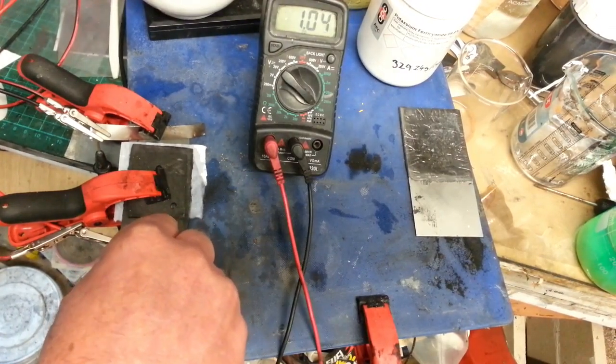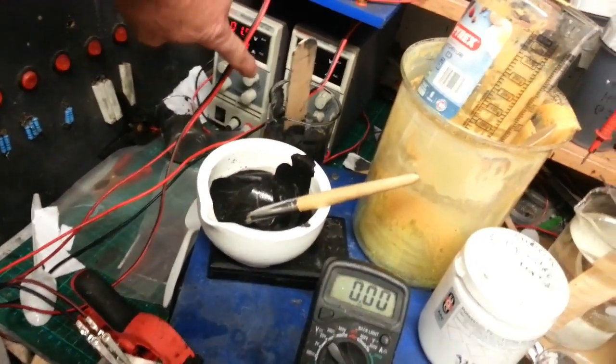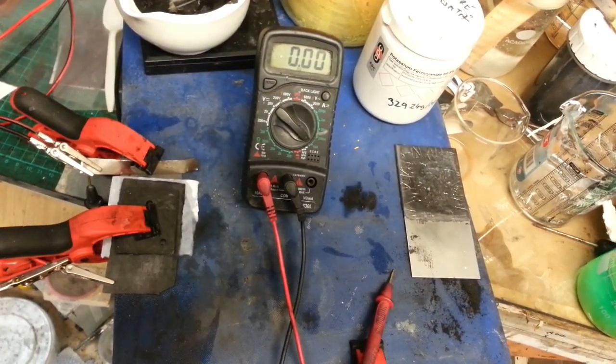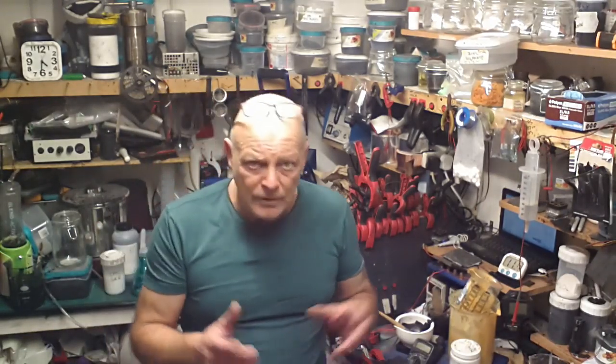It settled to 1.1 amps, then 1 amp - I'm not going to push it. I put the charger back on and it was charging at 270 milliamps, now down to 160. The camera's on an extended arm at the moment - whether I show more with this battery in this video I don't really know, but I wanted to say a couple of other things. For the amount of material on there to give that sort of short circuit result, I know there's potential in it. I just need to balance everything out and do a better construction.